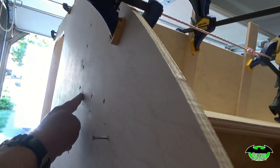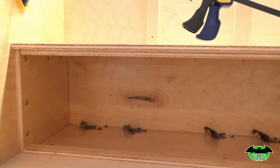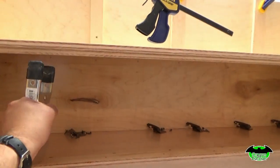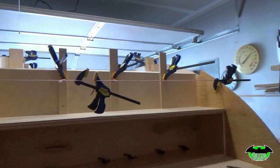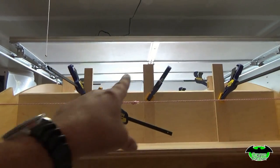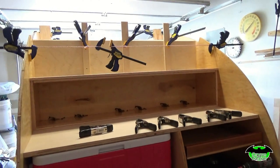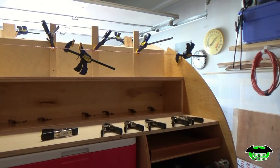The top is in and I do have it fastened here on the side with some screws. Now we're getting ready to do the face. I have three screws ready on each side, and we're going to spread some glue — get some glue down here at the bottom, and then on the piece itself, we'll put glue across the top and on the back side on this edge. We'll get that in place and then we've got some clamps here to clamp everything together and hold it in place. My little makeshift clamp up there is working pretty good — I have a nice tight edge on both sides, and we're setting flush in the back. I've got a couple sticks coming down so I can keep the bottom nice and tight.